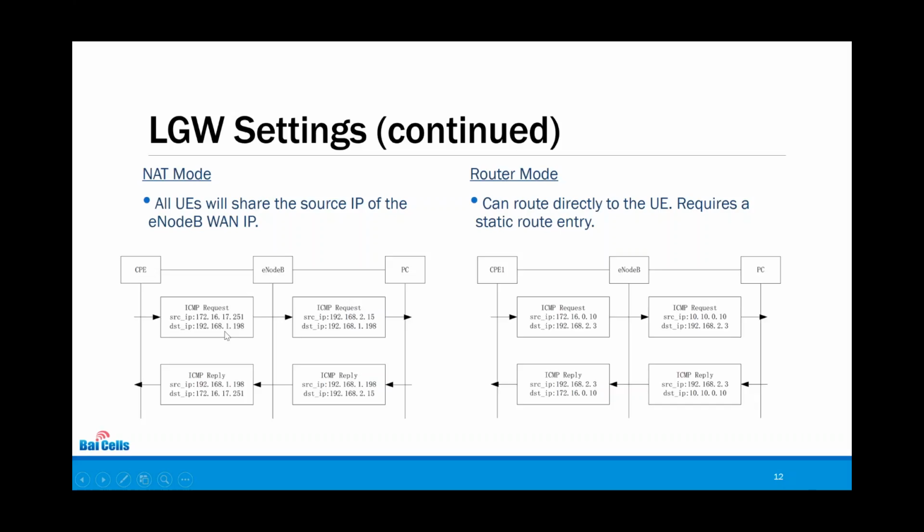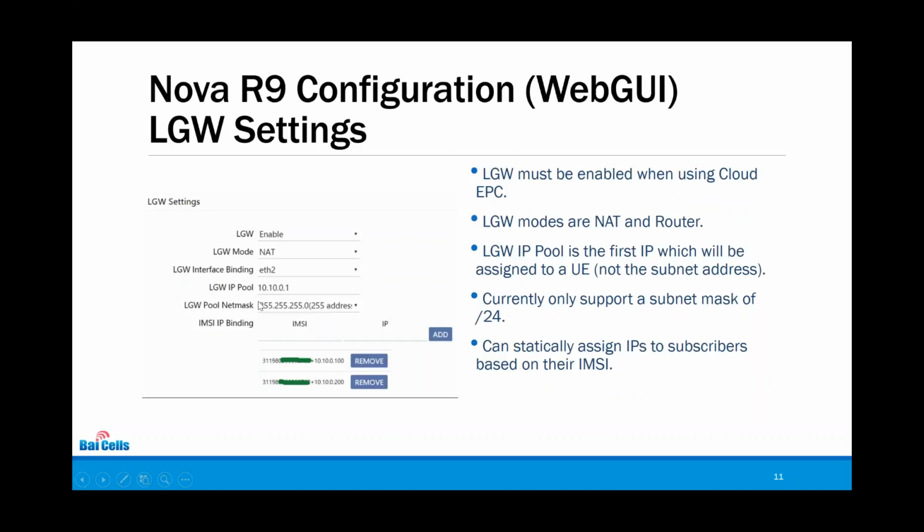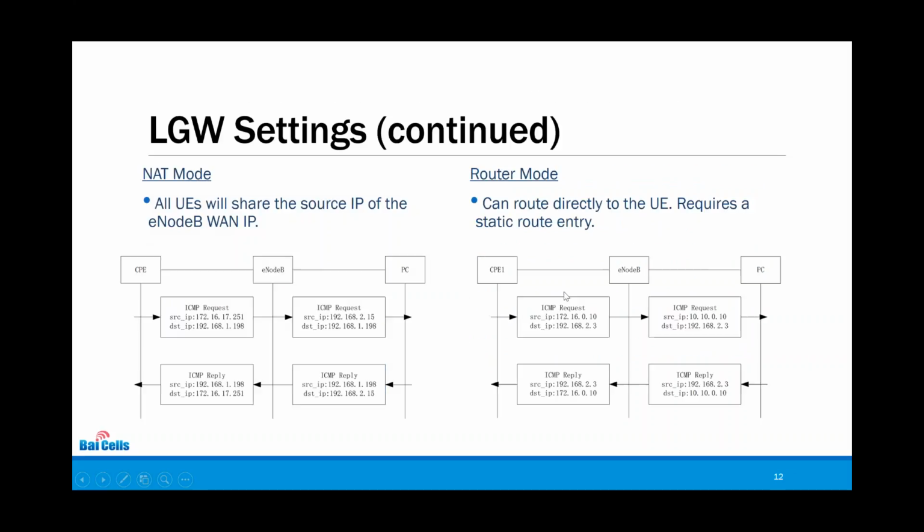What's different with LTE here is the EPC has to give the subscriber an IP address. We have no control, of course, as the operators, because the EPC is in the cloud, it's managed by Baicells. So you have no control of what that address is going to be. That's where LGW comes in. LGW will actually change the IP address of any subscriber. If we look at router mode, you'll notice that 172.16.0.10, for example, is retranslated to 10.10.0.10, which, from the last slide, 10.10.0 is the default network. So that's what we have to do. We have to retranslate all the IP addresses to make it work in the fixed wireless network that most operators have.